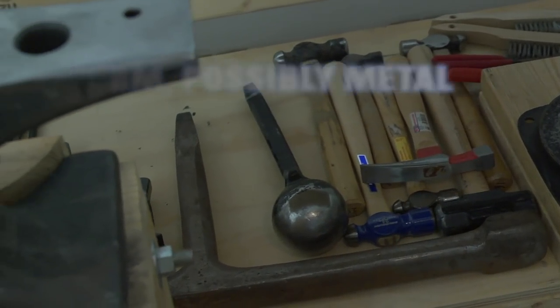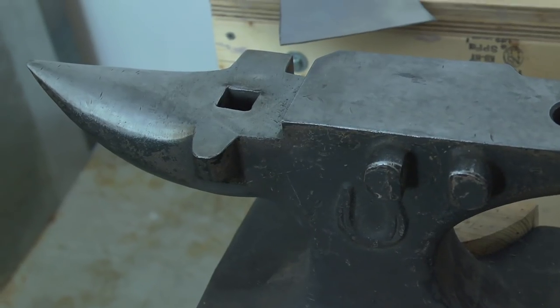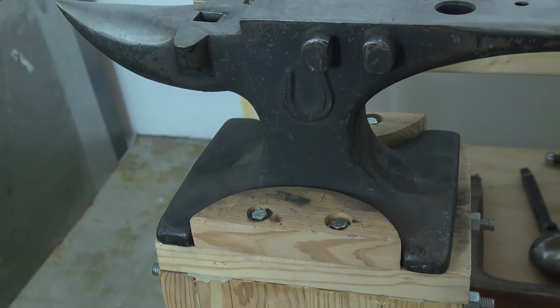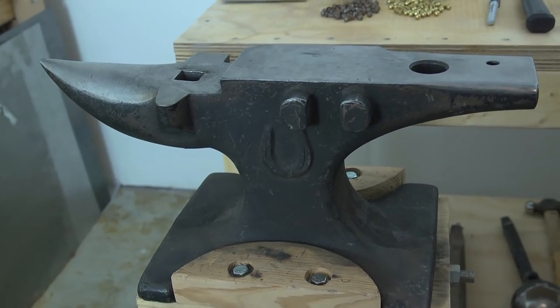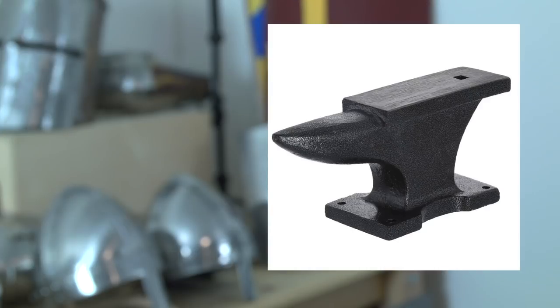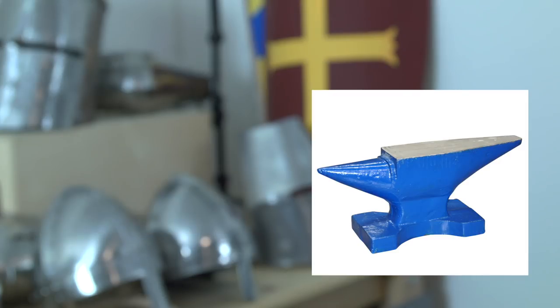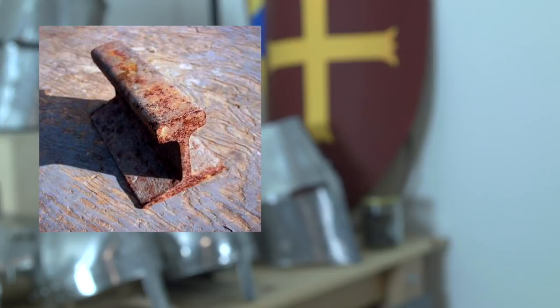Most anvils are sold by the pound. It doesn't matter if it's a hundred or two hundred years old — you're still going to pay somewhere between two and six dollars per pound. So if you're going to eBay or online to look for an anvil, you want to make sure you know what you're getting. If it's very affordable, you're probably looking at something cast iron, and it's not going to be the same as a real anvil. A proper anvil is heat treated and tempered to a certain Rockwell hardness, whereas cast iron is what you're getting — not a Peter Wright anvil — and it may be fine for a beginner, but be aware of its limitations and susceptibility to cracking and breaking.